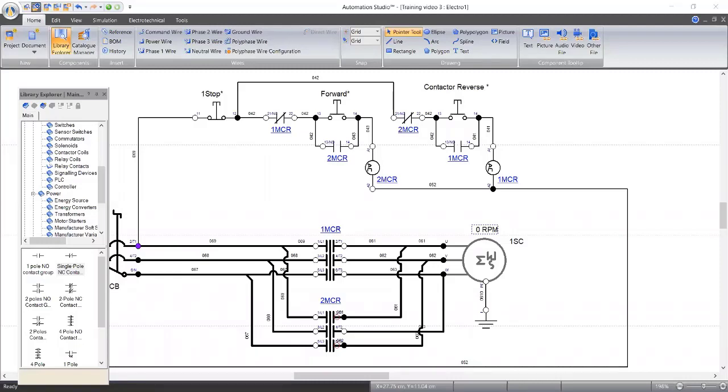Especially in a control system that uses PLC, you only need a minute voltage to trigger on and off anything. Because of that, they will also put that freewheeling diode, connected across the A1 and A2 of our contactor to make sure voltage will not go back to the source, to the supply.